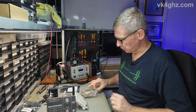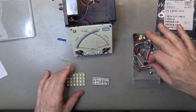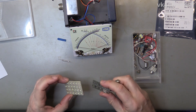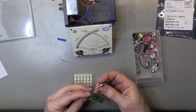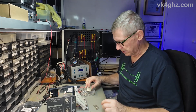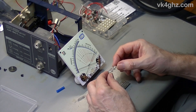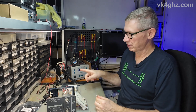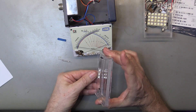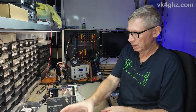Let's fit some LEDs. I went rummaging through my parts bin and found these modules — LED modules designed to replace vehicle interior incandescent lights. They come in various shapes and sizes. Off one of these I removed three LEDs and had to bend the pins over so they could be wired in series, but I found they're actually about two millimeters too wide to fit behind the meter cover, so the cover just can't go back on. I can't use those.